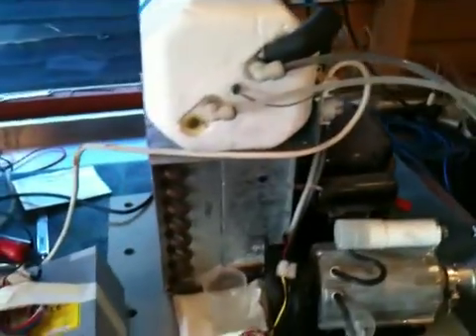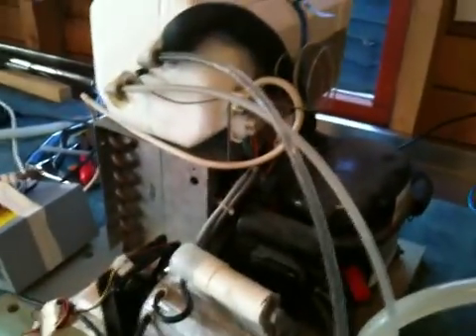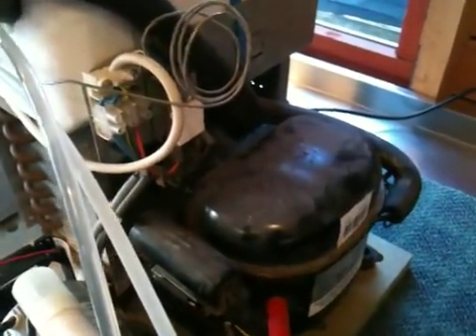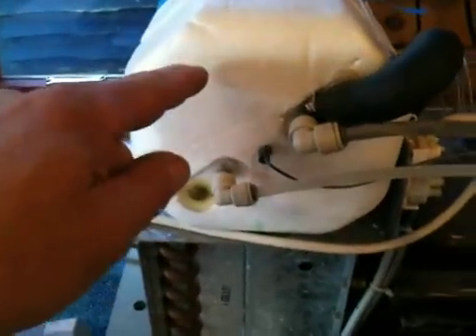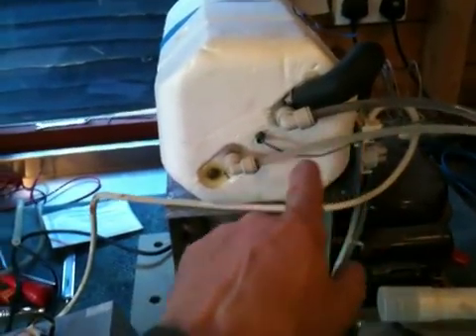The other two pieces of kit that are doing things: there's a water cooler — the kind of thing you find underneath work surfaces in the kitchens to do the cold tap water. There's a tiny tank here that's being cooled by the fridge unit and water is flowing in. The idea is mains water flows in there and the tap water comes out here. When you turn the tap on, you remove water from here that's been cooled to quite a cold temperature set by the thermostat.